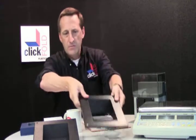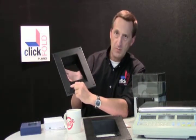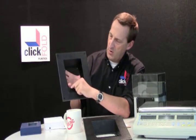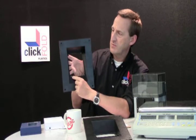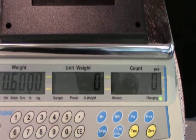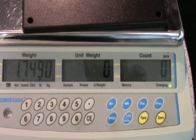Let me show you the plastic counterpart, where we eliminated the seam at the bottom and the gaps in the corners. We now have brass threaded inserts for our fasteners. And most importantly, we have a substantial reduction in weight. To be specific, our plastic bezel weighs in at 0.6 pounds, and its predecessor weighs in at 1.75 pounds — a 65 percent weight reduction.